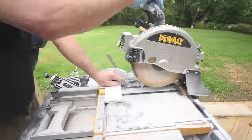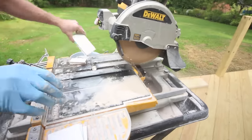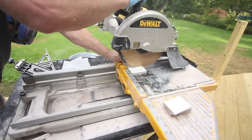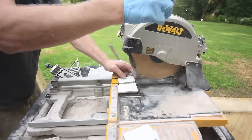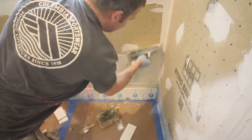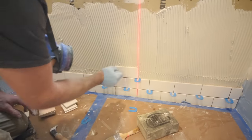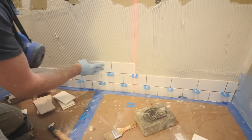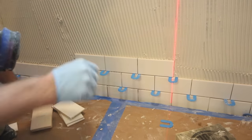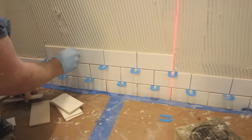We're getting the measurement for the smaller pieces. One way that we saved time on this project was batch processing these little cuts using our DeWalt wet saw, which, by the way, is our favorite wet saw. That sped up the process of tiling the first several rows of this subway tile shower. We're continuing with our directional troweling, setting the first tile and making sure it's centered on the previous row, then going up the wall using our horseshoe shims to get our consistent grout joint.